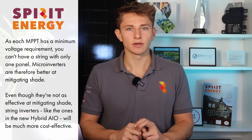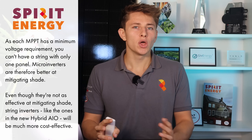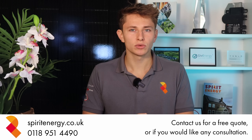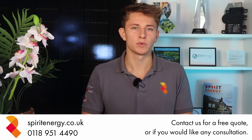With the six MPPTs in the GiveEnergy All-in-One, you won't have to do this anymore. Of course, it's not going to be quite as good as a microinverter, and you can't have one panel on a single MPPT, but it will be a lot more cost-effective. The better these string inverters get, the less financial sense panel-level electronics make. If you're being pushed a system with microinverters or power optimisers, it's worth looking at this new GiveEnergy battery or the Tesla Powerwall 3 as a cheaper alternative, if your designer's a bit clever with the stringing.